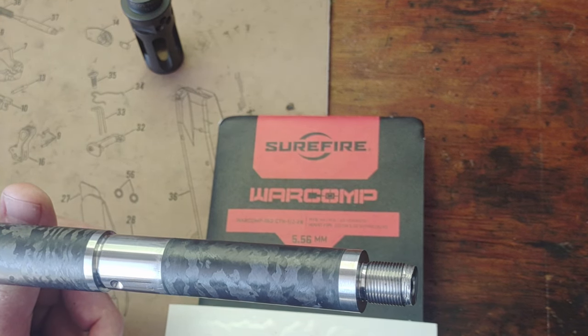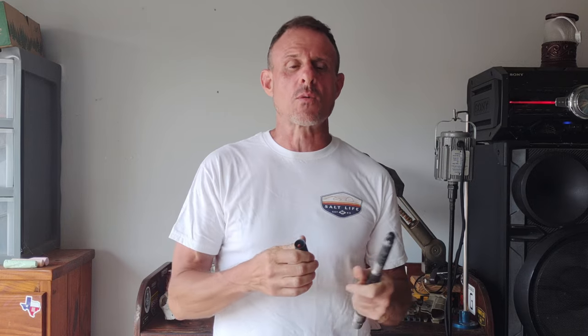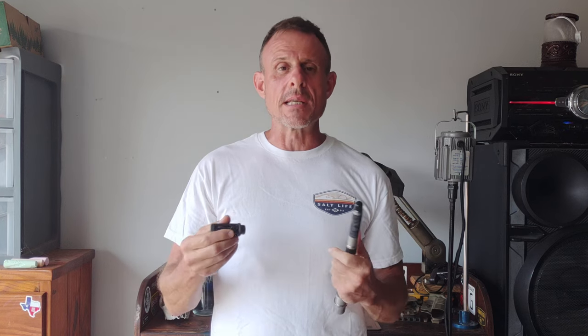As soon as it happened I broke out in a sweat. I thought I must have cross-threaded the barrel, but that was confusing to me because when something is cross-threaded it doesn't make four or five solid 360-degree rotations. So I began to research online and I had seen where some people maybe had the same problem. I decided to call Proof Research, and they immediately told me which compensator I had used without me telling them — so I thought it was a little strange that they already had some foreknowledge of this being a problem.